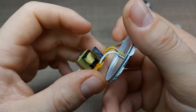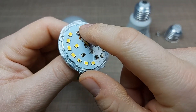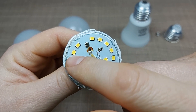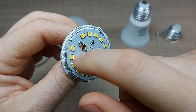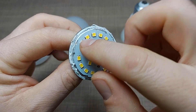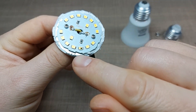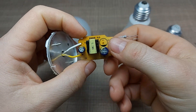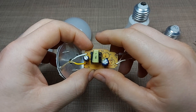The chip number is MC5833B — probably a dedicated LED driver chip. There is a diode, a few resistors, and a capacitor, probably to define the current the LEDs will receive. There is also a resistor on the output end and another smoothing capacitor rated at 2.2 microfarads 400 volts. Using that high a voltage rating on the capacitors indicates quite a high voltage across all the LEDs. Since they likely use LEDs with multiple chips, each LED probably turns on at more than just three volts — I tested with a small battery and none of them lit up.